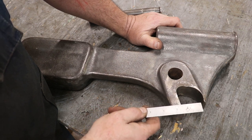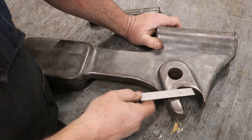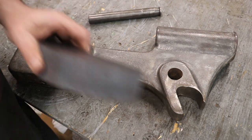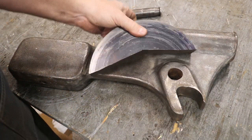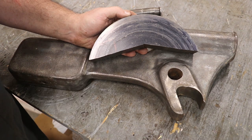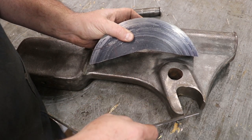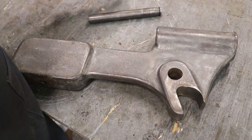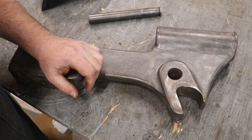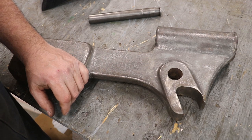What I'm gonna do is we're gonna take this over to the mill machine, and I'm gonna mill this thing out, nice and square and flat, take this radius out, basically, and put a piece of metal back in there. And what I've got to work with is this piece right here. This is some scrap left over from when I did that flange job on the steam locomotive. This is actually cast iron right here, and it's extra material. So I will machine a matching piece to put that metal back in out of this material, and we will then reattach it to the piece. And I'm debating right now as to whether I'm gonna use a mechanical fastener or whether I'm gonna braze that in there. We'll figure that out once we get into the project. So for now, let's head over to the milling machine.